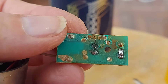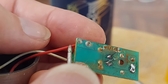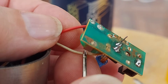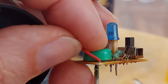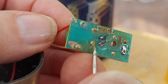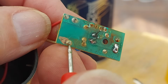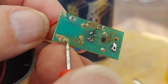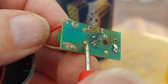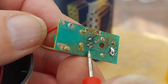Looking at the circuit board — that is, I'm guessing, the positive leg. The red wire going down to the solar panel, and that white wire back there is the negative leg from the solar panel. So the positive leg goes to the positive of the battery. The white one goes over there, and then that tag there is a diode going over to there. That track must be the negative of the battery. So negative of the battery along that track, through a diode, over to the solar panel — so the solar panel is feeding the battery via that diode.